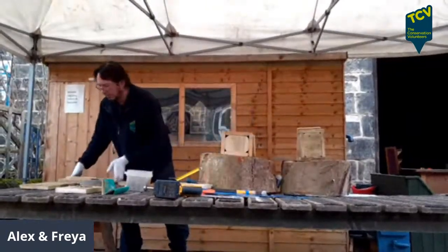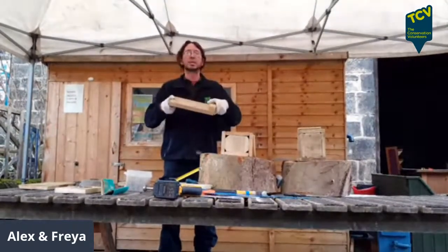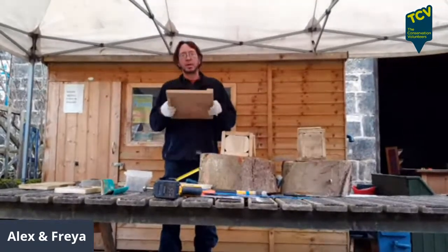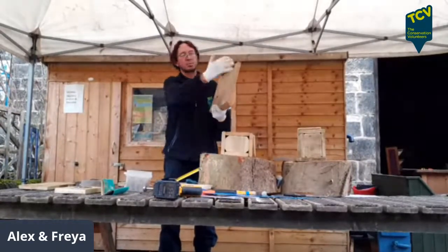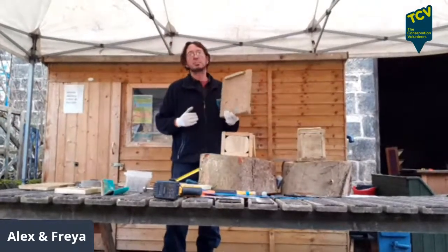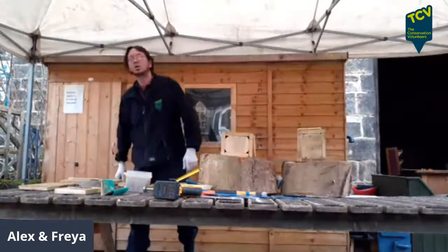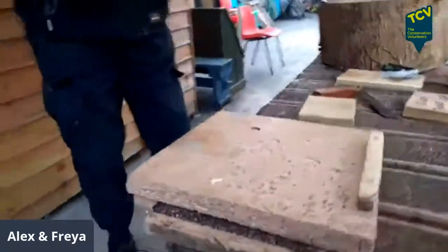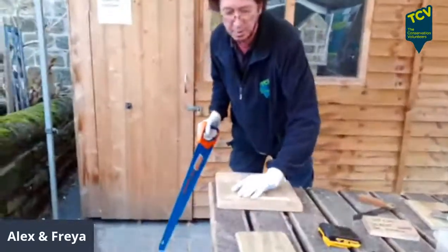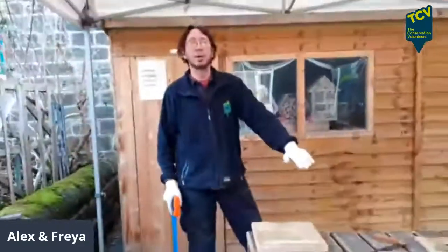If you're doing work at home, these are great things. It's called a bench hook. Basically, it doesn't matter, it's got holes all over it. It's not precious. It doesn't matter how big it is. It's an edge piece that hooks onto your table, not going to damage the table or anything like that. Plus, you can always use it to do your cutting. So I don't have to use a clamp, it's not going to slide away.